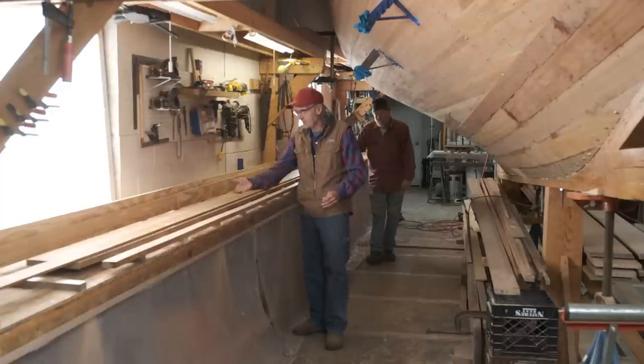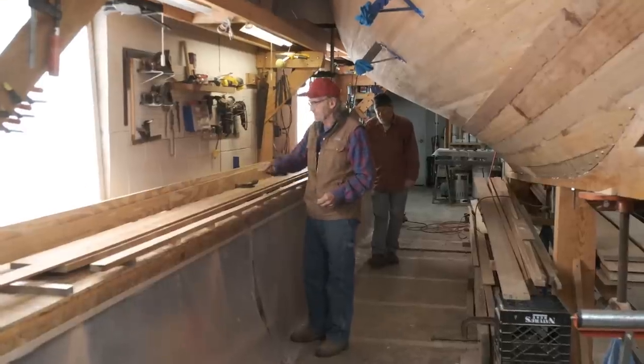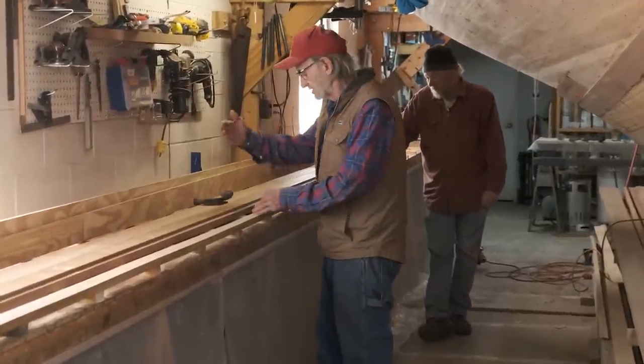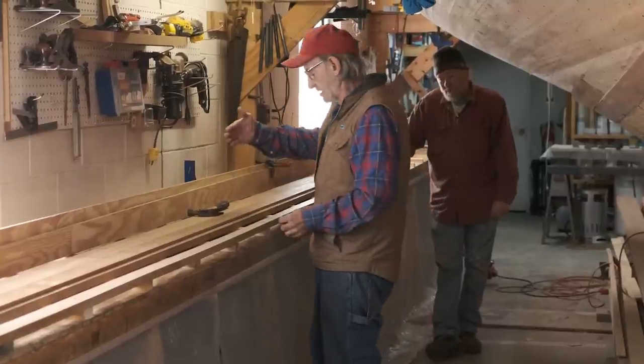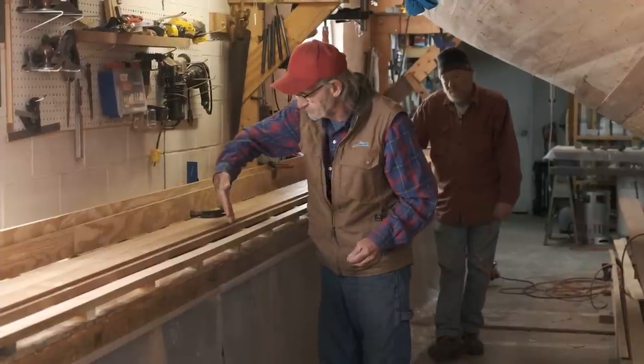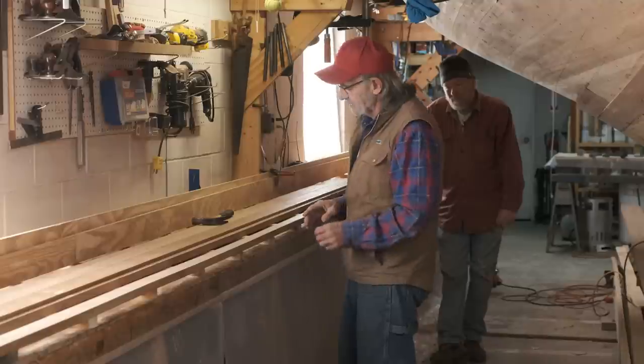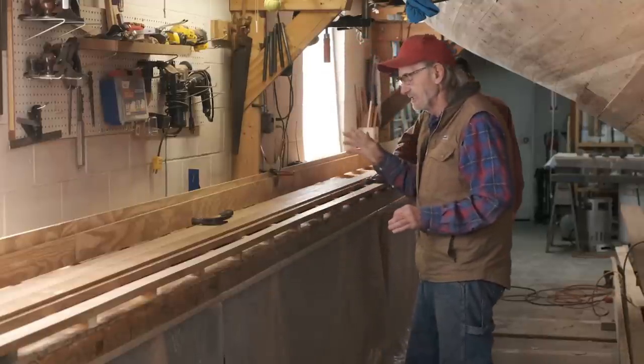The first cut, the plank is right side up. This is the outside of the plank. But once we cut the top, we're going to flip it. We're going to be cutting the bevel on the bottom of the plank. The saw will actually add the bevel to the plank from the measured spot. So we'll go into that when we get involved with bevels.